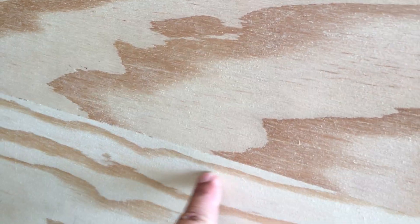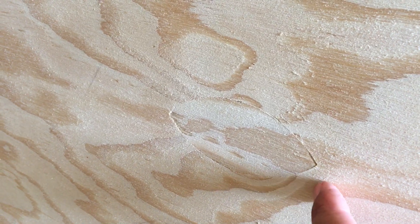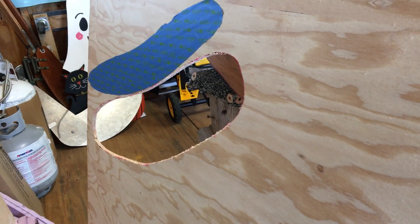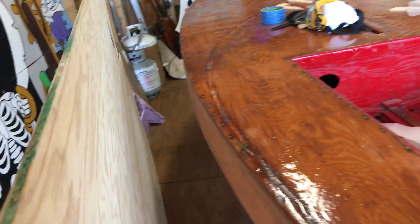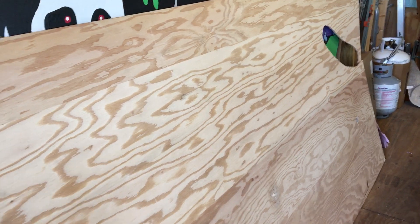Now I'm not sure about any previous A-B marine I've bought — this one actually has two different pieces of wood matched up here. The grain is pretty good, but they also have these little football-shaped plugs where there's some kind of knot or imperfection. The machine cuts out a chunk — basically that's the same letterbox or plug-type repair we're talking about — and sticks in another piece. This side is the better side, the A side, but there are limits to how much they can putty and plug and still call it A. Honestly, this is the crustiest looking piece of A marine grade plywood I've got, but I can't be picky. We're kind of lucky to get it at all. Even though we live in a coastal area, it's just not something there's a whole lot of use for at mom-and-pop lumber stores other than marine construction.